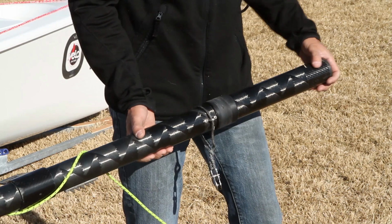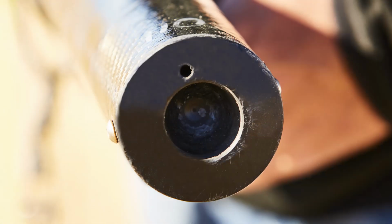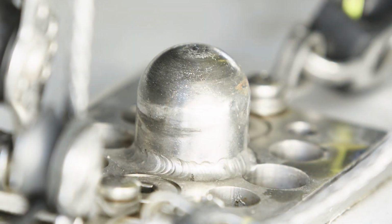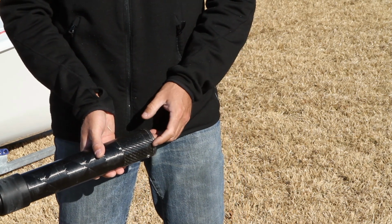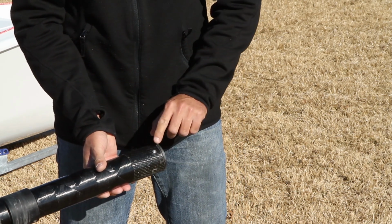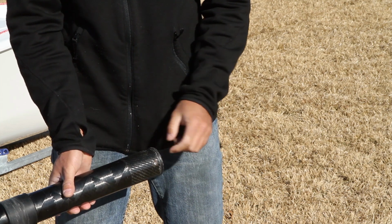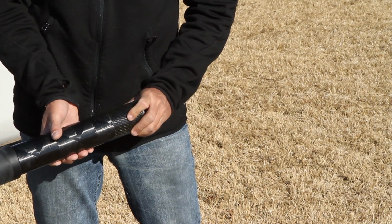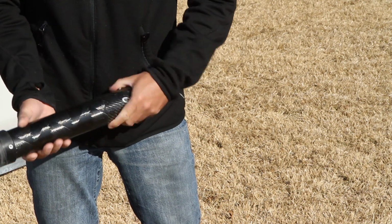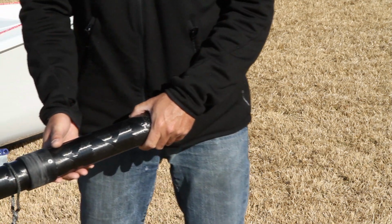And at the bottom of the mast, we will be able to see there is a cap. You probably cannot see from this take, but there is a little ball. The ball fits inside this mast butt cap and allows it to rotate with very, very low friction. Both pieces can be replaced. They have just a couple of Allen screws. The piece can be pulled out and replaced after its wear and chafe. And with nothing else, we're going to proceed now to step the rig and get the boat ready to go.